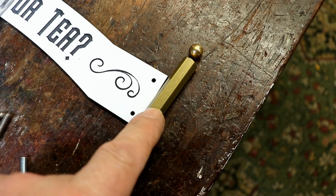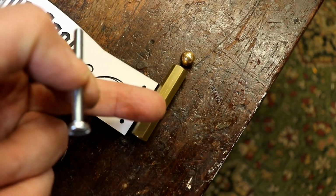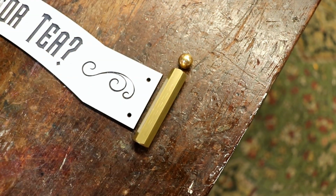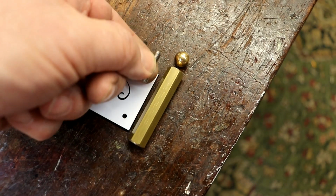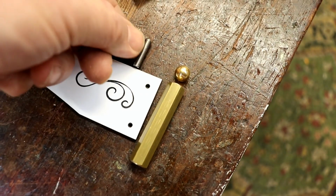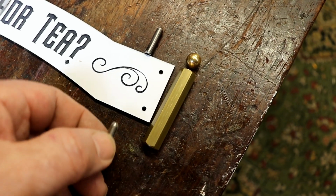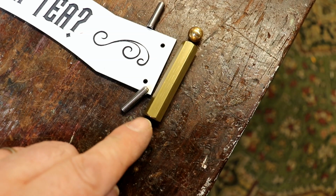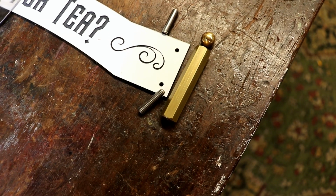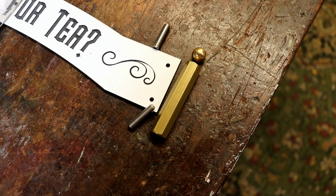Now, what I've got to do is fix the ball on one end, that in the middle, and then this needs to screw through the top of Florence's cabinet, 3mm ply. I thought I could cheat and just drill a 5mm hole through the middle, but the longest M5 screws I've got are just too short. So what I think I'm going to do, any excuse to prolong the agony, is to drill and tap a 5mm hole in the top, M5, and use one of these little bits of M5 studding I've got, which is basically just like a bolt or a machine screw but without a top on it, and there's another bit which I use at the bottom, and then I can just put a nut underneath up into it to tighten it down to the top of Florence's cabinet. Then drill 2 little holes there and tap them out to M3 so I can screw into them.